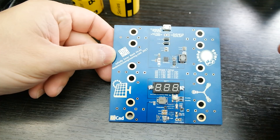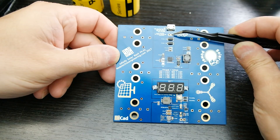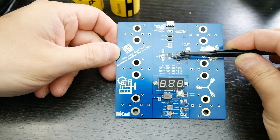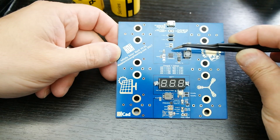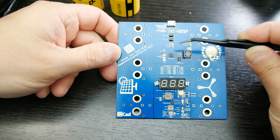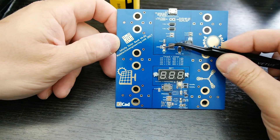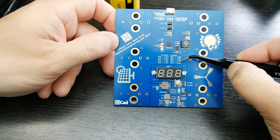On the completed circuit board you have two options for input power — you can use solar on either option — a micro USB port or a regular through-hole for a permanent connection. It passes through two zener diodes to protect the charging IC, which is the ZSPM4523, though ZSPM is now bought out by IDT in America. This protects it from over-voltage; it runs beautifully at about 6 volts input, along with the current sensor resistor, its inductor, filtering capacitors, and the ability to reprogram it if you have an I2C to USB adapter with its associated pull-up resistor.